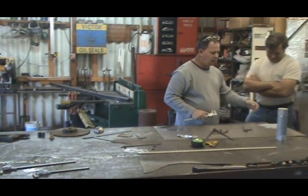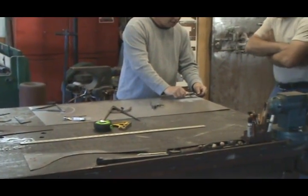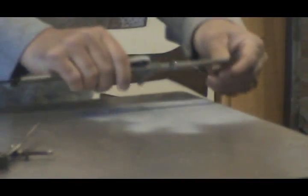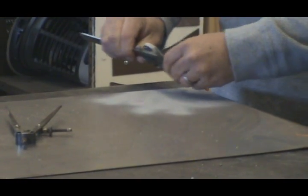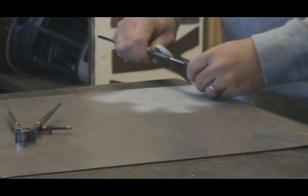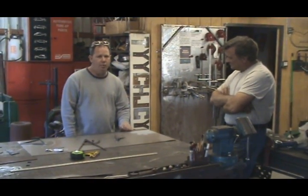Let's do one other thing here — let's lay something out with a pair of calipers. Say we want a bolt pattern laid out for a caster. We set it for a half inch off the edge of the part and scribe a line. Then we make it three and a half inches from the end and scribe again. We do the same thing on the other side — half inch from the edge, then three and a half again — for our simple bolt pattern. We used a little bit of primer on the surface. You can use Dykem or a lot of other different things. That's a really simple way to just lay out a simple pattern.